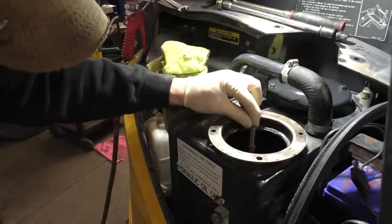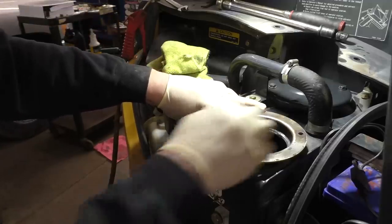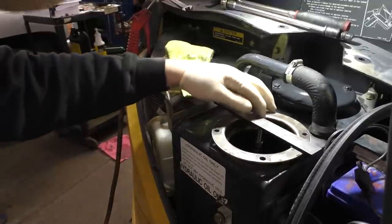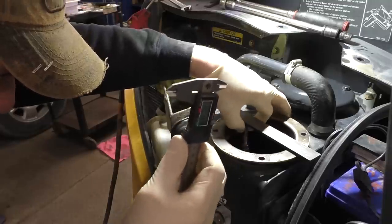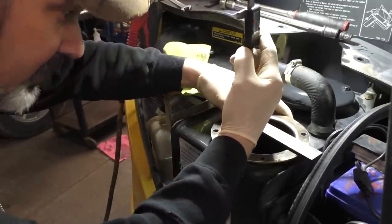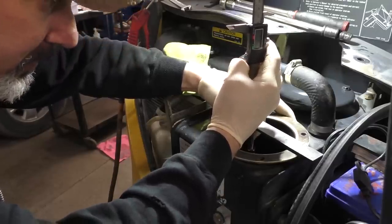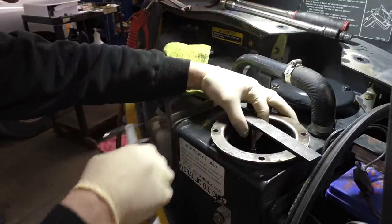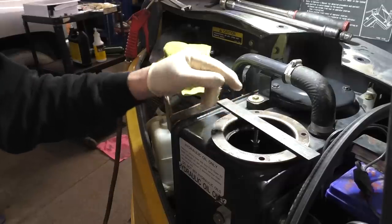And I guess we could get a measurement, albeit crude, across the straight edge down to the top of that nut. Let me get some measuring device. Sort of straight edge on here, we'll stand that up. And then let's see. Let me just go down to that nut, see where that's at, sitting straight. That sits kind of offset. Okay. 1.9, we'll call it 1.903. Plus, you know, the thickness of our bar.